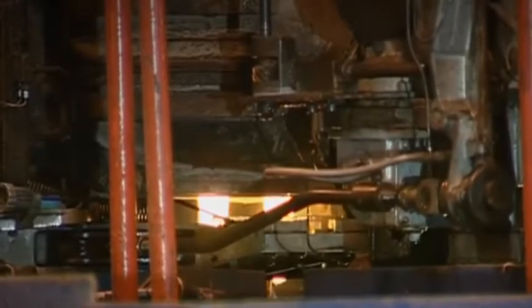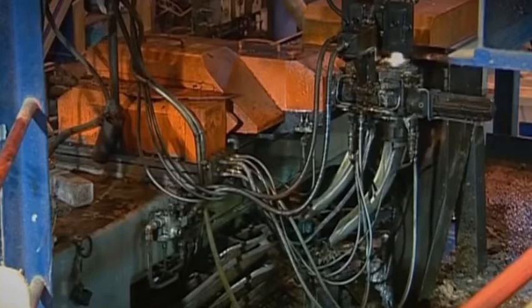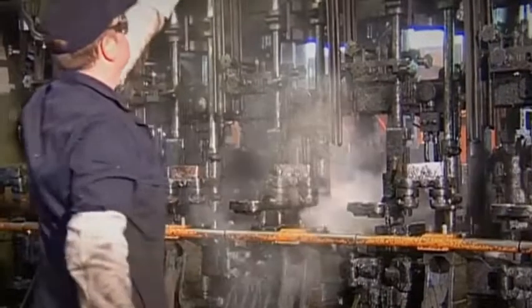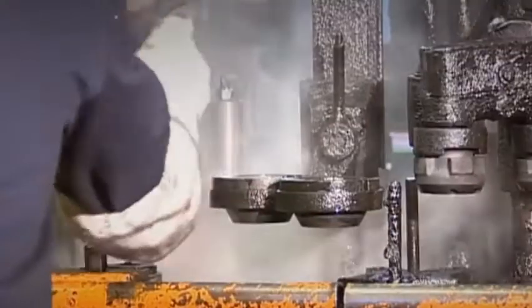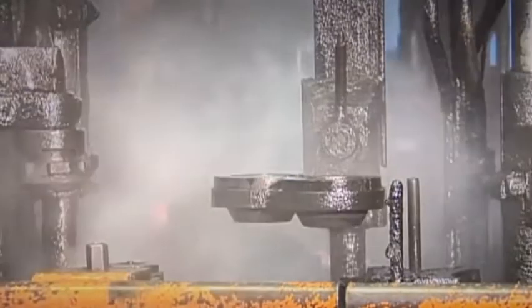They cut the molten glass into viscous lumps called gobs. Like little balls of fire, the gobs are directed by steel chutes, taking each one to the bottle-making machine. And this poor chap has a very dangerous job. He has to keep all the moulds clean with an oily stick, looking out for the gobs as they fall in, so they don't burn his hand off.